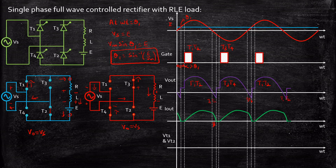Now what is the voltage across thyristors T1 and T2? Before that, why does the waveform start the way it does? If you carefully observe, we have a pattern starting like this here. When we extrapolate, we get the same pattern, because n number of cycles have already passed — we simply copy the established pattern. The same holds for the output current waveform as well.